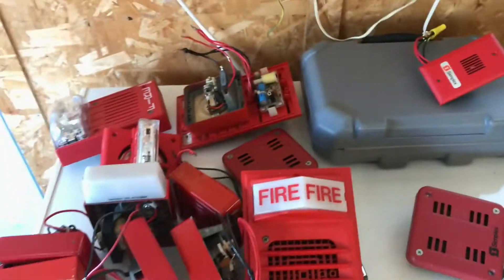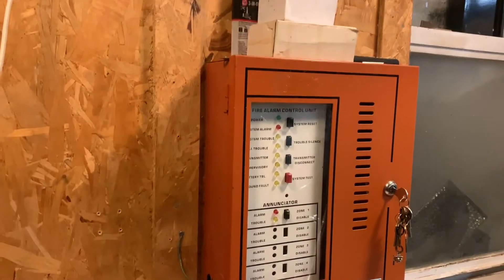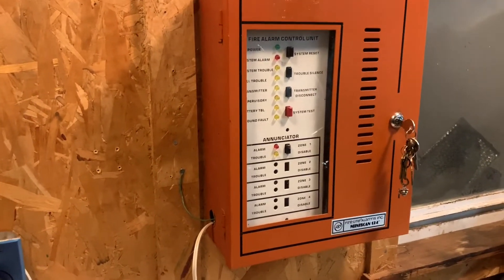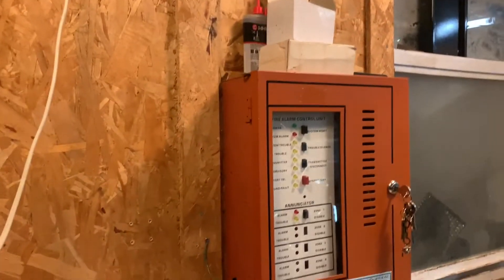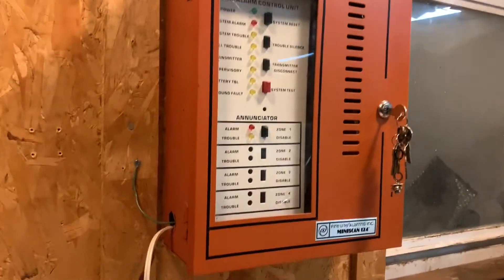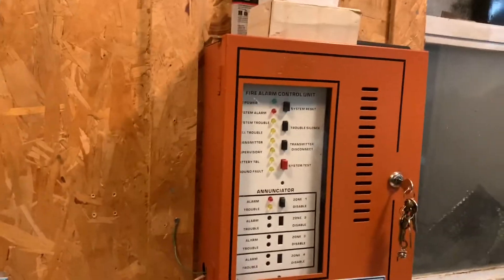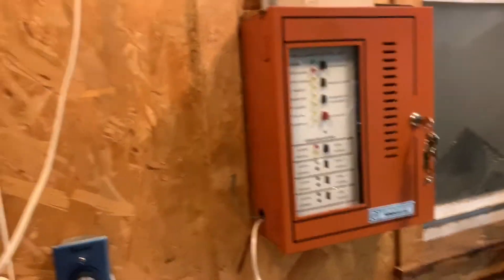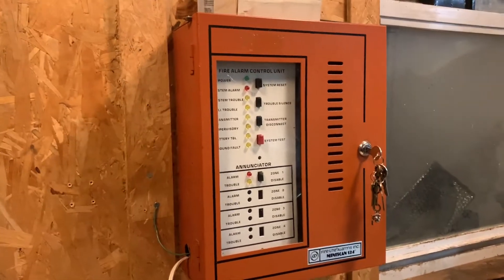Thank you for watching, and have a nice day. This is just a little follow-up to the video I just finished. Long story short, I filmed that video roughly two years ago and I've talked to fire alarm collectors since then. I kept saying this panel has a problem of putting out FWR power, but in truth it could also be that the capacitor inside the panel is going bad, which could also cause these horns to go raspy — because this thing had been in use since 1984 and I think they replaced it around 2016.